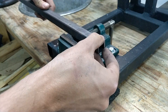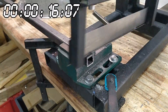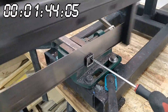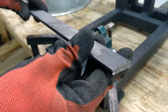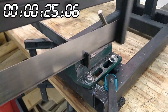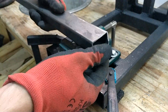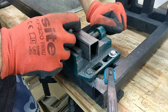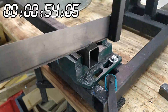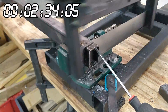Now for something a bit more challenging: a 20x20mm steel square profile. Here I did speed up the footage a bit — it takes a lot longer to cut, but it got the job done after a little less than 2 minutes. Next, a piece of 30x5mm steel bar. I found it cuts a lot faster if you clamp it vertically — this one took about 1 minute and 13 seconds. Next up, a 30x40mm steel profile. That yellow smudge you see me adding before each cut is WD-40, which lubricates the blade and significantly improves its lifespan. This one took about 2 minutes and 47 seconds.